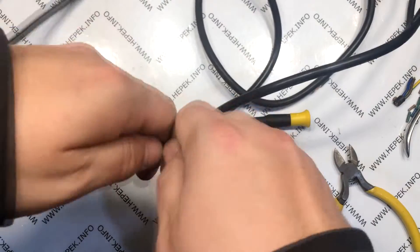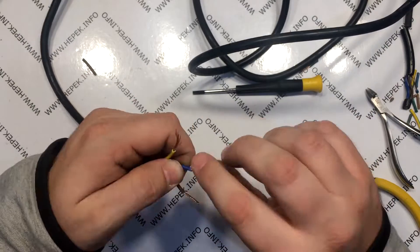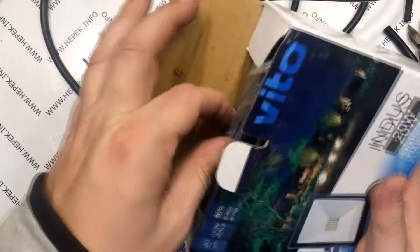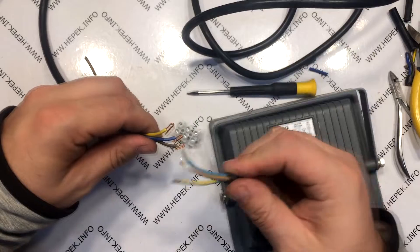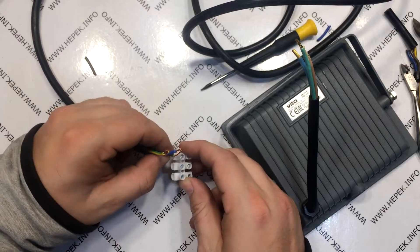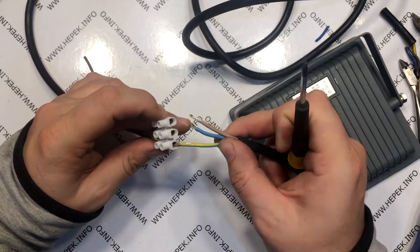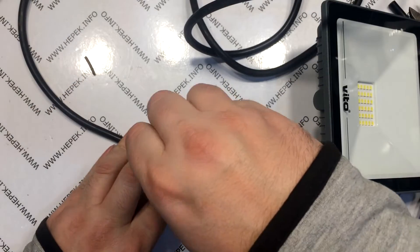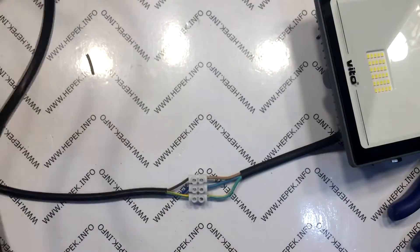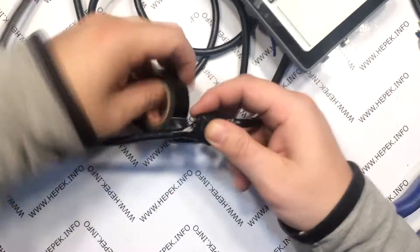I peel off the black part of the insulation, then strip the wires. I twist the wires and cut three clamp terminals. I bend the wires to double the thickness. Now unpacking the second floodlight — here the wire colors match, so not much brain is needed. I insert the wire of the cable with the plug into the terminal and screw in the screws. Then I insert the wires from the floodlight into the clamp and screw in the screws. I pull the wires to see if the clamp holds. Then a quick test to see if it works. Works great.